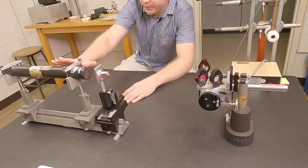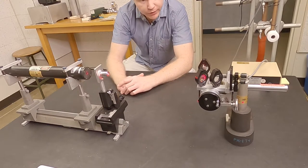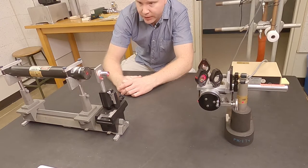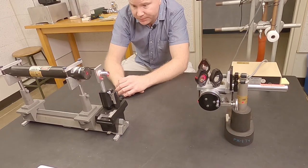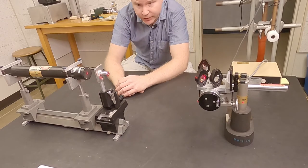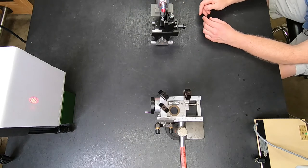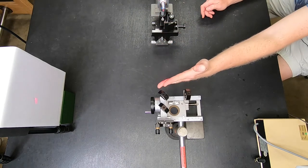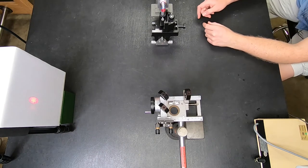The first part of this setup is the helium-neon laser, and I've left this on for a while for it to stabilize so that the wavelength of the light has come to stop moving and the size of this chamber has come to thermal equilibrium with the surrounding air. That light gets focused with this microscope objective to a pretty small point nearby, which then gets spread out to be about as big as this set of mirrors here.